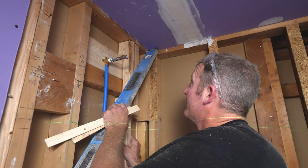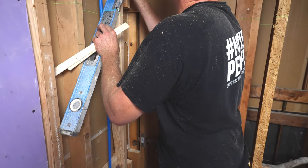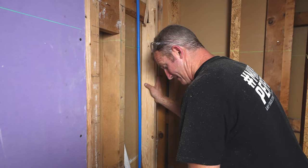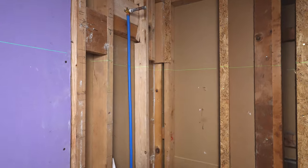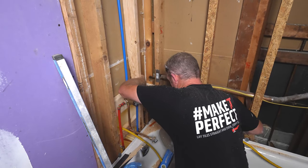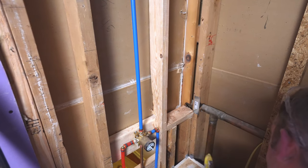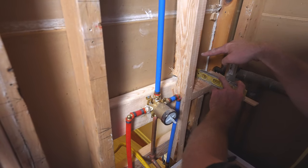In this wall, you want to make sure that whatever you put in here is going to stay even with one another. So you always want to check this flatness as well. And I'm going to make sure that that 2x4 is level. If you have the ability to slope it in, I would just go ahead and do that when we make the niche, because when water hits in this niche, you want it to run out.